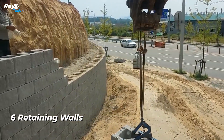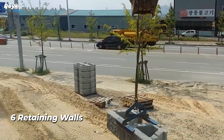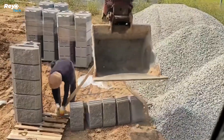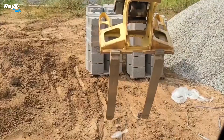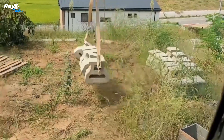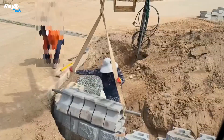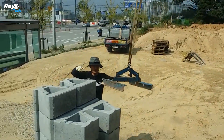Number 6: Retaining Walls. Workers at various locations are hard at work building retaining walls to keep earth from sliding. These walls can also be used for decoration at times. Builders frequently construct walls up to 3 meters high without employing reinforcing materials — they simply stack the blocks on top of each other. Smaller 45-kilogram blocks can be moved by hand if necessary, while larger blocks can weigh up to 500 kilograms, and in more elaborate walls, blocks can weigh up to 1,600 kilograms.